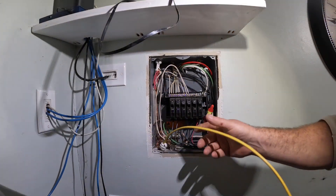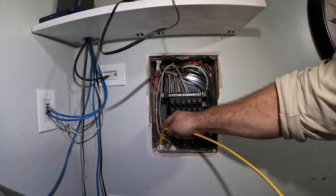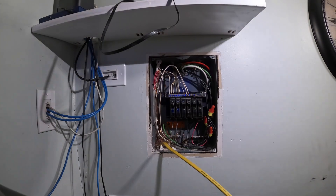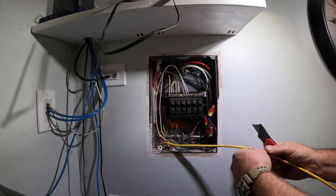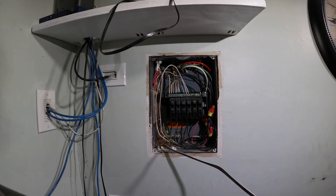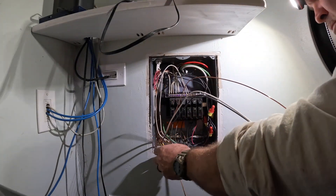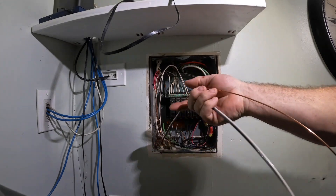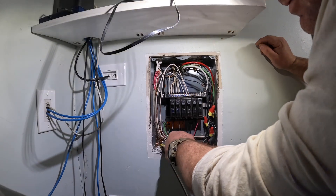I received a lot of comments about these white button connectors — I just slide it on right there, and the wire is already inside the cabinet. It's a two-way connector which definitely makes life easier with a flush panel like this one. This is an old panel, probably 1990s, so it's over 30 years old. I wound up replacing all the circuit breakers the next day when I connect my double pole circuit, and at some point I'm going to change this panel out because of its age.